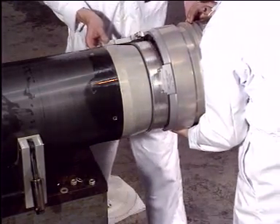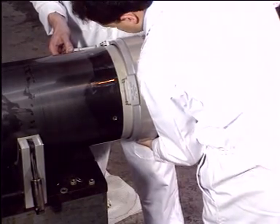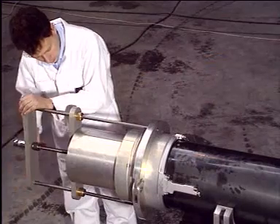Grease the capsule having previously fitted the seal bullet. Refit the upper gland housing onto the piston by sliding it carefully to prevent damage to the seals, bearing and outer surface of capsule. Use the appropriate tool to place it safely into the piston.